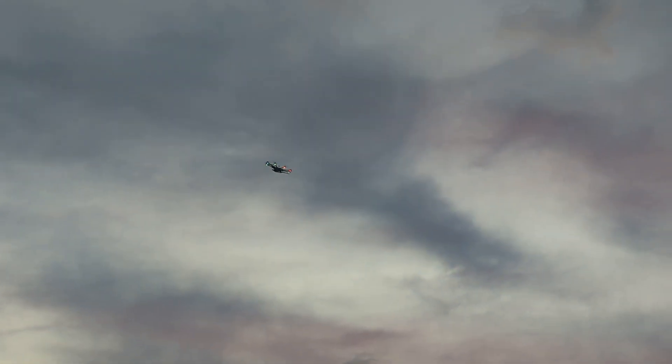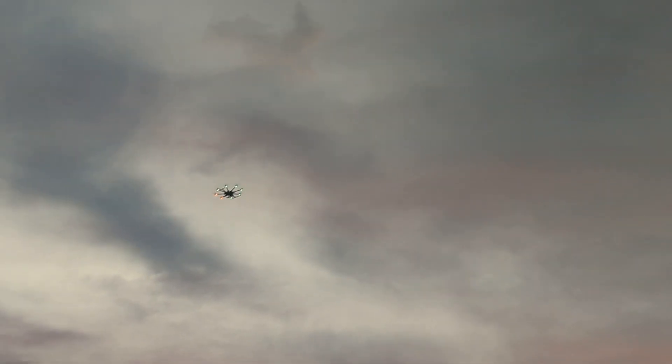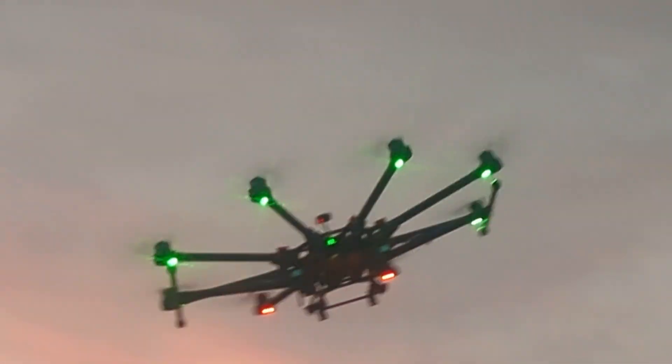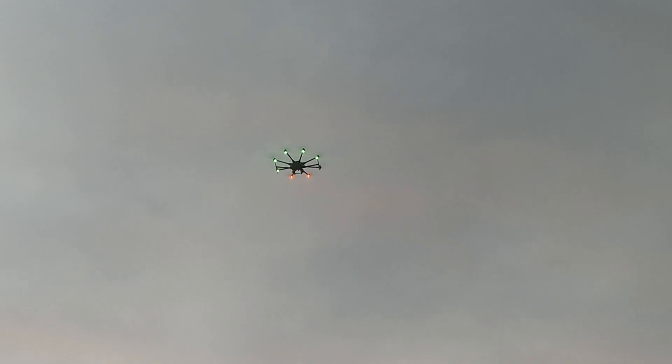There's that little brake. Now I'm going to go back into altitude hold — so now we don't have GPS locked. Now I'm going to go into stabilize mode, which is the manual mode for this drone and our helicopter. So now I'm controlling throttle, which means I can make it descend a little faster, I can make it fly faster, and back to altitude hold, and back to GPS hold in loiter mode.